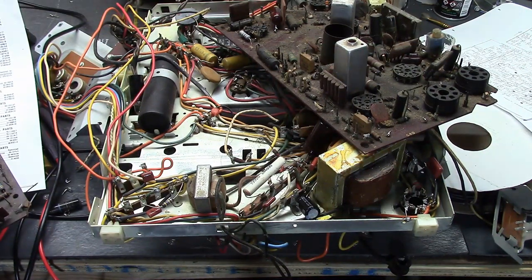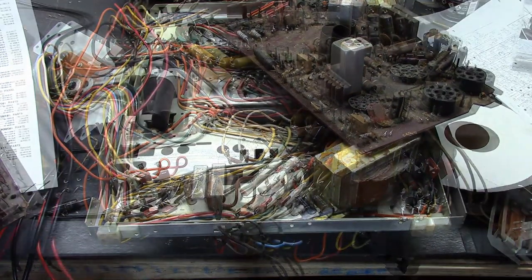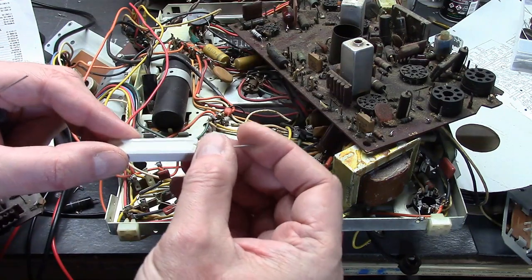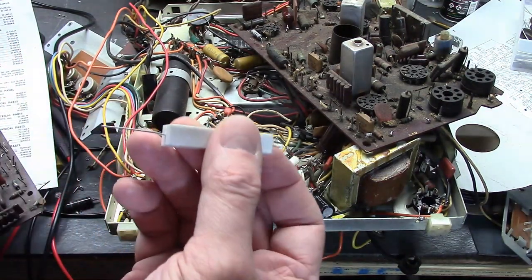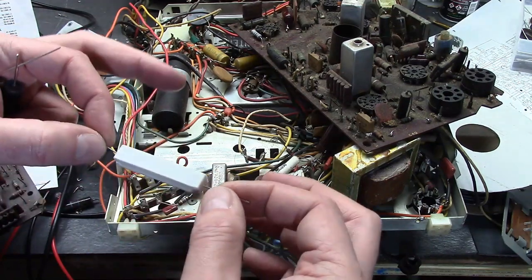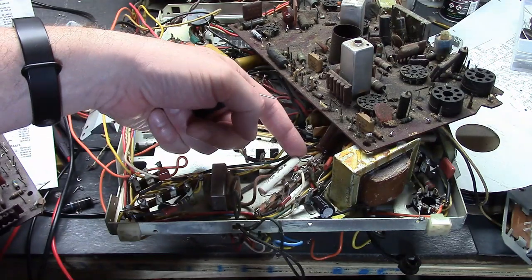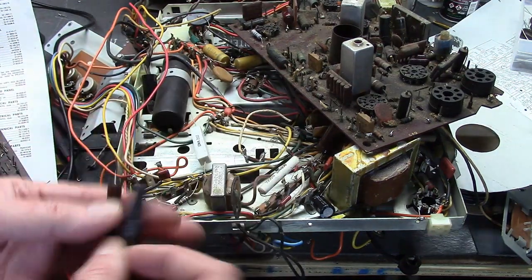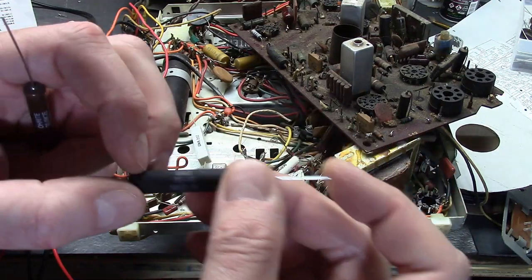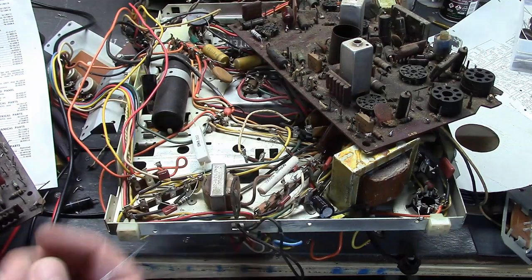There are cheaper ones called cement resistors. I'm not crazy about them — these are the cheapies, cement-type filled ones. I don't like them for a couple reasons. One, these are the type that tend to get that corrosion on the ends. But also the leads, at least on the modern ones, are really flimsy. This thing is kind of heavy and they just have these dinky leads on it. The lead gauge on the quality type is probably two or three times what it is on the cement ones. I prefer the vitreous enamel type with nice sturdy leads, made by Ohmite. Or this one by Dale with a silicone synthetic coating. They will cost considerably more, but much higher quality in my opinion.